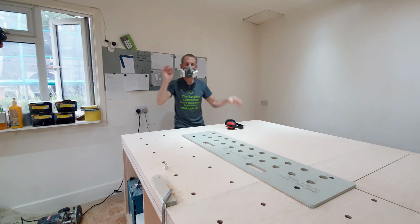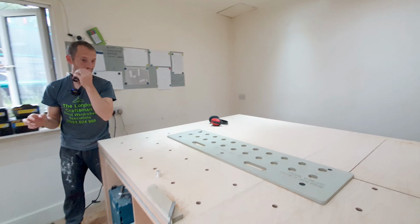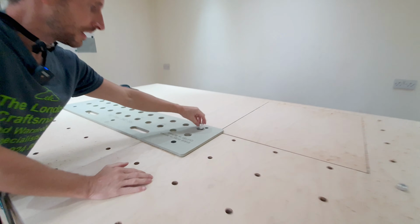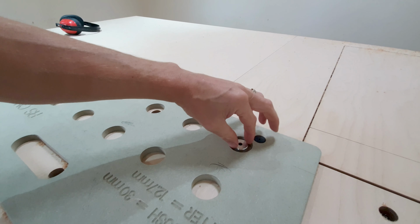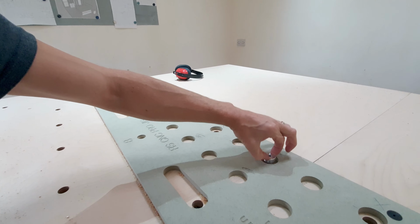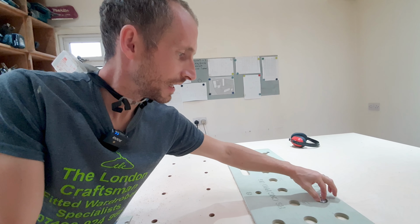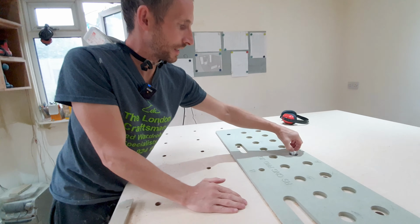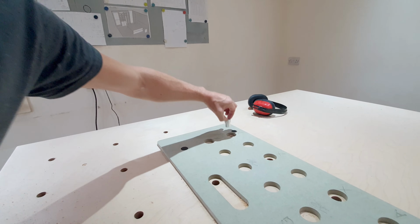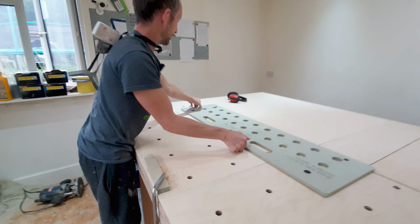Right, so you heard a tiny bit of that meat being taken out again from the last pass. Let's see. So this is a standard dog. There we go. Perfect. Just enough resistance. Remember, we're lacquering these, so we don't want them so tight because they're only going to get smaller. That goes in, that goes in, that goes in. So basically, that is how you use this jig.